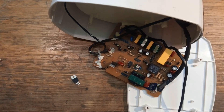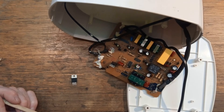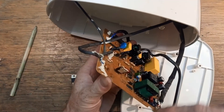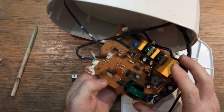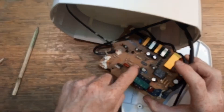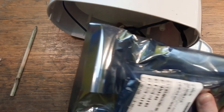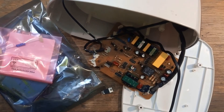I'm going to replace them all and see if it works. If it goes bang again, I'll bin it — so that's the task of the day. I'll pause here because desoldering and soldering, especially when attached to a large device, is quite fiddly. I'll desolder the two MOSFETs, the driver chip, and the limiting resistor, then come back when it's done and check that the parts I ordered have all arrived.